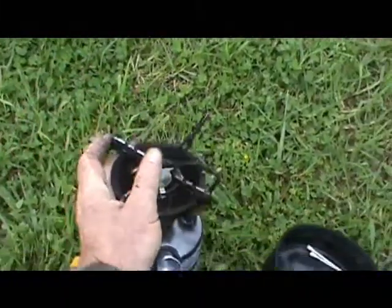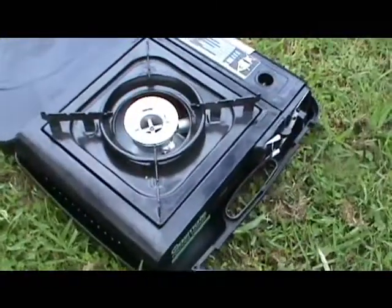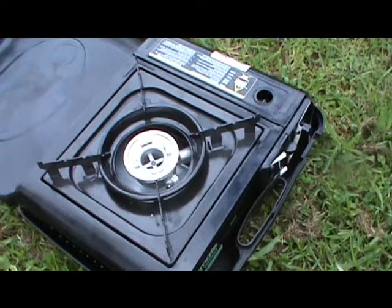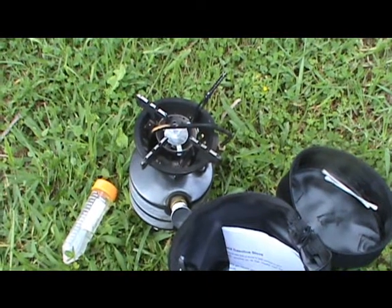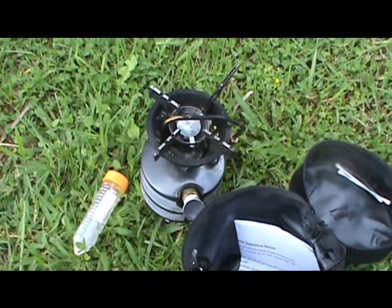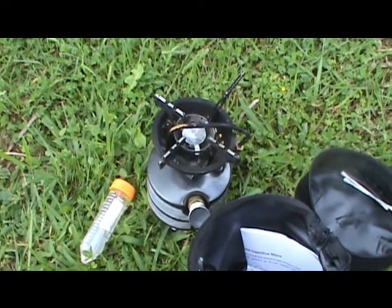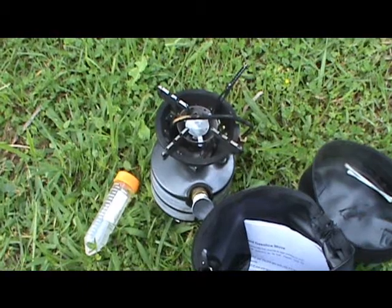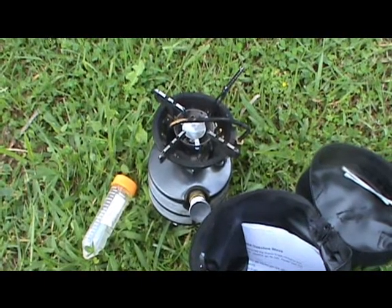I know with these types of stoves in sub-zero temperatures, particularly with heavy frosts, there is a gas flow problem from the canister into the burner. With these ones, the fuel you've really got to look out for is diesel. Diesel — just pure diesel with no anti-freeze additives in it — does freeze and turn to a gel. And when it warms up, it doesn't reconstitute either — it just stays as a gel. So that might be something you have to consider for much colder climates.